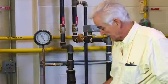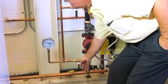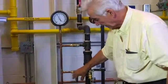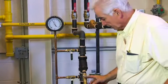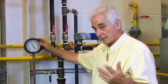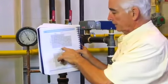So that's how to calculate pump performance. To see what size impeller it is, you do a deadhead test — shut the valve at the discharge of the pump. Open this valve to see what pressure you have there, open this valve to see what the pressure is ahead of the pump. What's the difference times 2.31? That's the deadhead pump head. And then, if you want to see what's happening when the pump is performing, start with all the valves shut — make sure they're all shut or you get a bypass. With the pump performing, open this one and see what the reading is, open this one and see what the reading is, take the difference in psi — that's the performance head — and multiply by 2.31 to get the operating head in feet of water column. Head in feet of water column to the right impeller size, straight down the chart, tells you how many GPM.